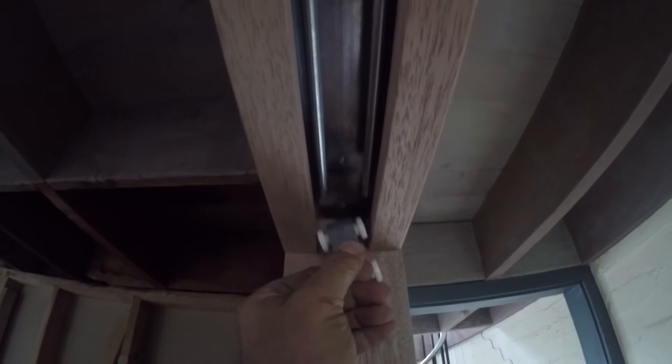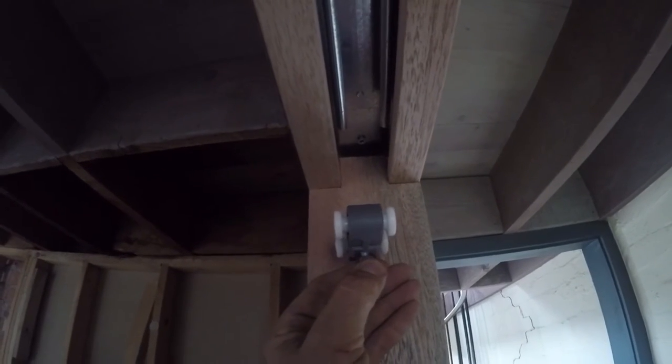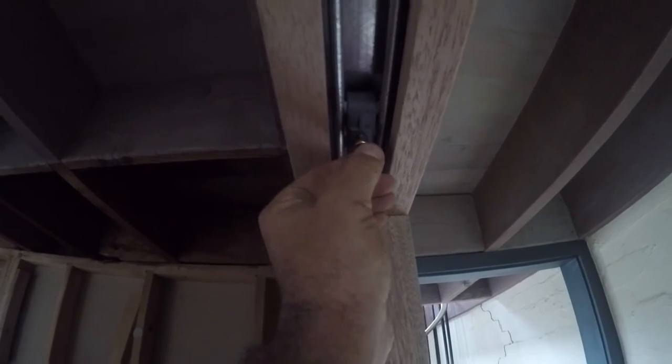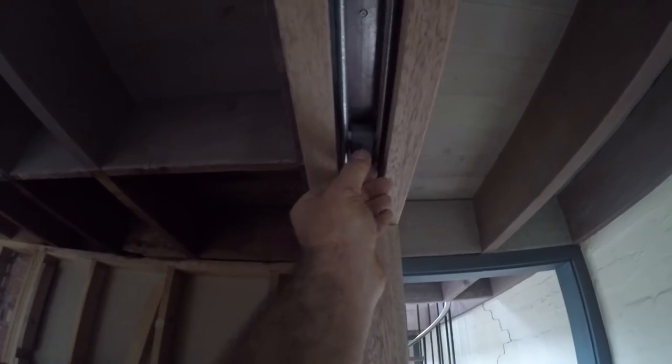So here we're going to move to this roller. You've got a U-shaped roller here. If we come over here, you can see that we've got our four wheels — two on each side. And what that does is it makes sure that the pressure is coming downward. If we use a solid door here, a semi-solid or a hollow door, it doesn't matter — this is really well held into place.